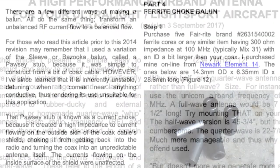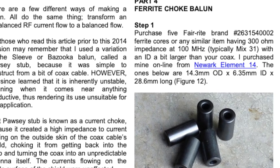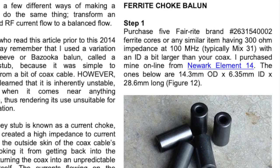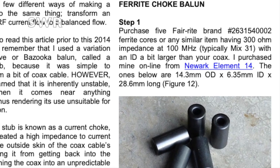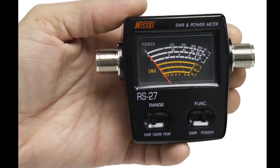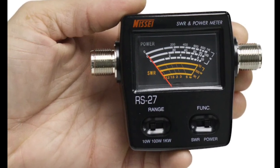The primary difference is the author is now using ferrite baluns instead of the poly balun. I also plan on borrowing my dad's SWR meter and fine-tune both these antennas to the proper lengths for maximum performance on our aircraft.